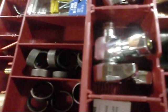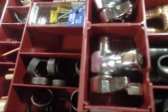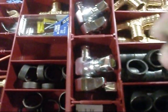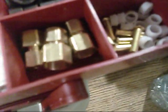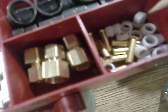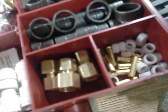And what I'm actually going to be doing today is I'm going to run in a water line for Mom for her new refrigerator, so we can get her an ice maker up there now. So I had to buy this piece here too. This is 3/8 compression to 1/4 inch. And thanks so much, Al, for the great advice here. I actually went out and got me some of these nylon compression rings, ferrules, and that way when you're using the polyethylene 1/4 inch ice maker line here, it won't cut into it like a brass ferrule would.